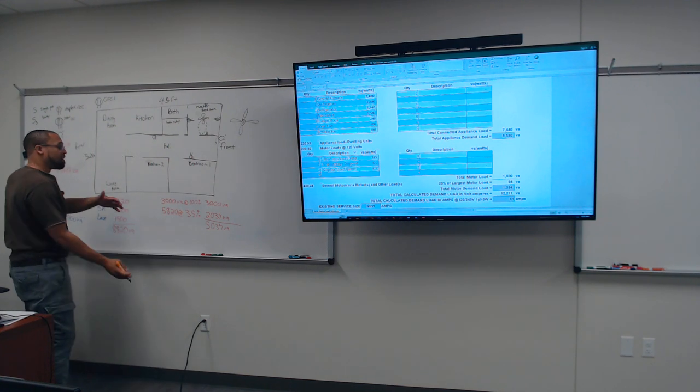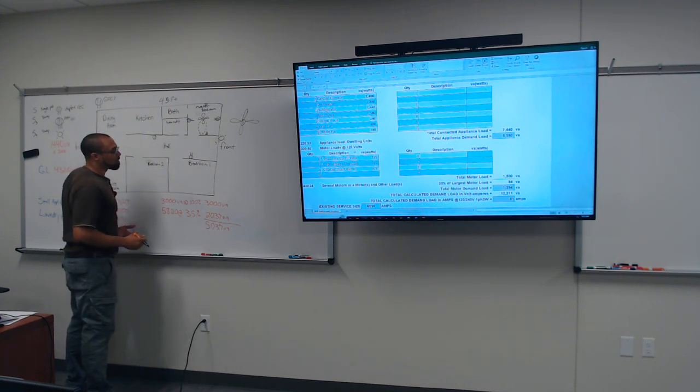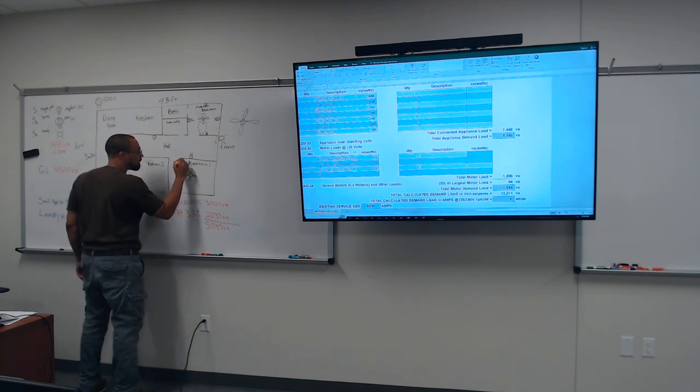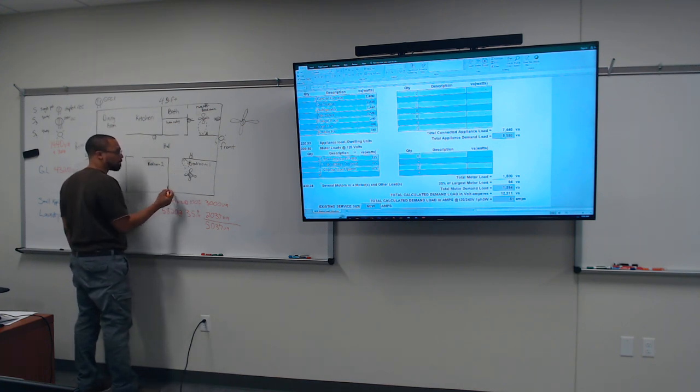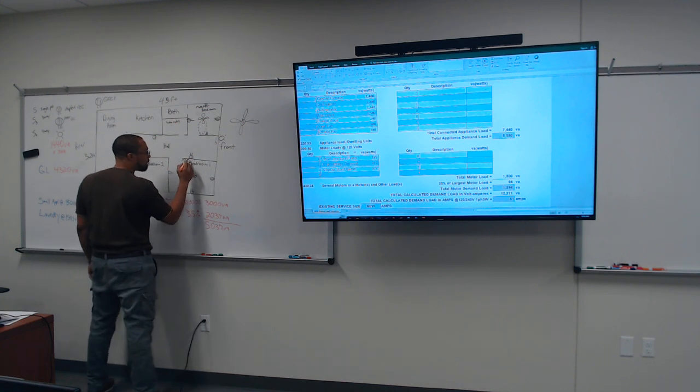All right. Now, since we're all right here in front, let's go ahead and knock out this bedroom. Bedroom number one. Same thing. Y'all want a fan or y'all want a regular light? It's up to y'all. All right. Bedroom that don't get a fan. So right here, I'm gonna put a ceiling fan as well. Single pole switch for the fan. All right, I'm gonna put a receptacle on each wall. Back to back.